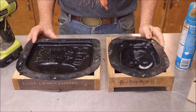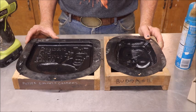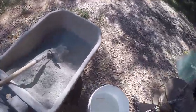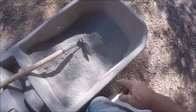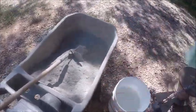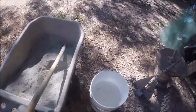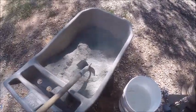Once you've got your reference holes drilled, your boxes made to hold them level, and you've got release agent of your choice on them, you're ready to start mixing concrete. I've got this dry mix mixed up pretty good. It does take a lot of dry mixing to get the fiberglass material mixed in — there's some visible here but it will mix in completely when you add the water. The more you mix the fiberglass dry, the better it incorporates. Also, the green colorant — or whatever colorant you put in — doesn't show up in the dry mix. It'll show up a little when you add water, but don't be tempted to add more color than you really need. It's an experimental thing — you have to just piddle with it and you'll finally learn.